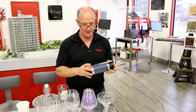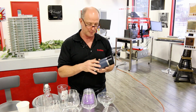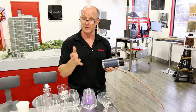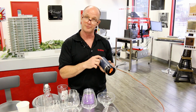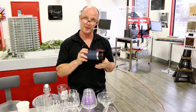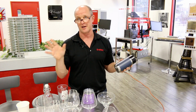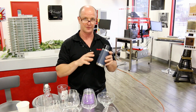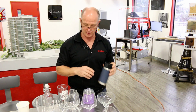If you take a look at a Yeti here, and I'll go through a video on doing a Yeti mug, a lot of times people want the logo in the middle of the E and the T here. And so again, not only are you establishing with the customer that that's where they want it, but you can also, in your mind, think, well, that's a great location for my red dot pointer lineup. So when I put it in, I line up in between the E and T. I don't have to think about it. It just goes in and off I go. Okay, so these are things that need to be thought about when you're actually looking at this. And when I do the individual videos, we'll try to touch on that so that you understand a little bit more what I'm talking about.